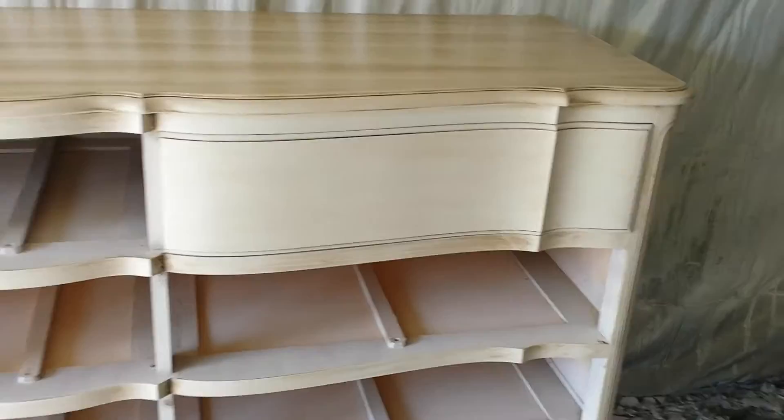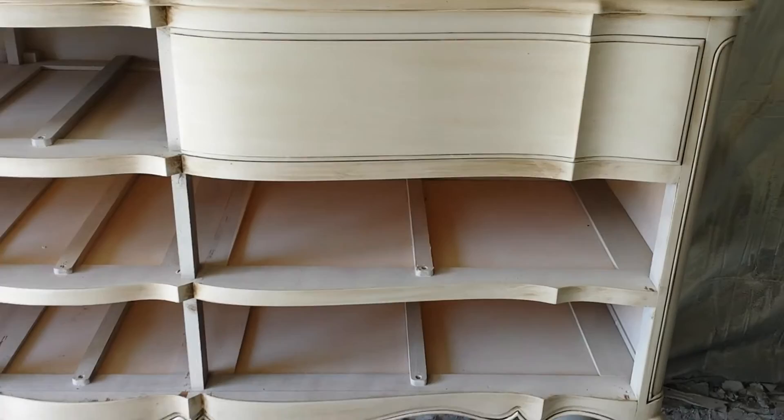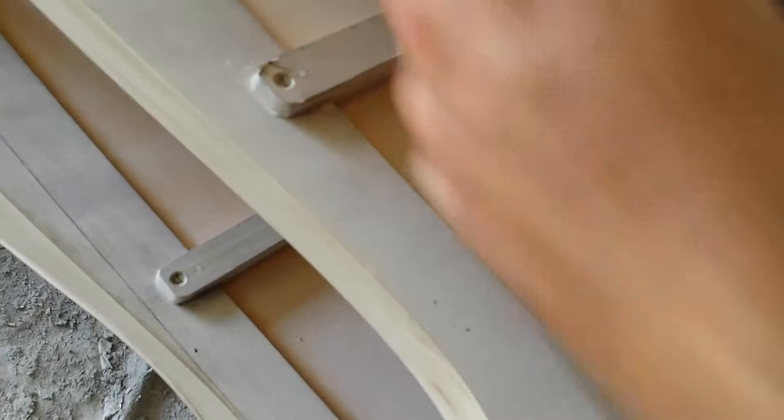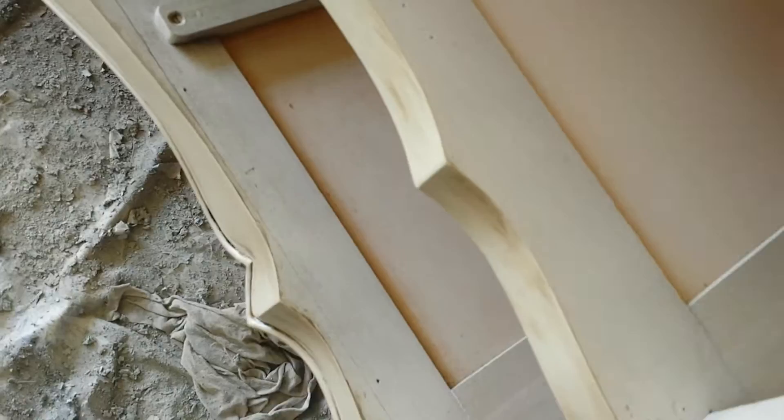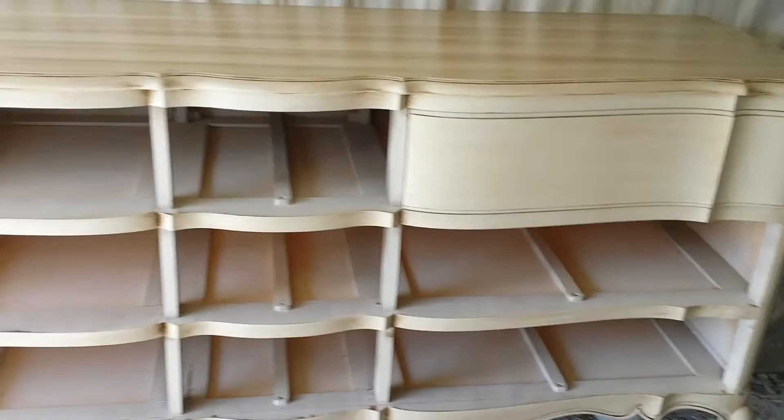Let me get this drawer in here. Drawers are a pretty big challenge because you have to make sure that you get the color tone even. Once you go to do more drawers, you need to make sure that you rub off the same amount of stain. You can see already where I put it in — the tone is different. This is darker right here, so I can come and rub it, make it lighter and make it match. See that? It's like a perfect match. Drawers are a real big challenge just because you need to make sure you wipe off enough stain as you did on the other one so they all match.